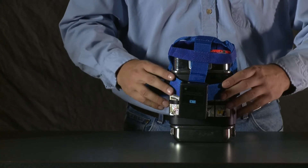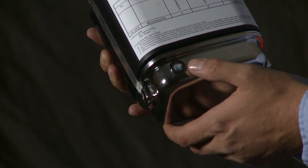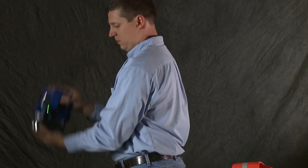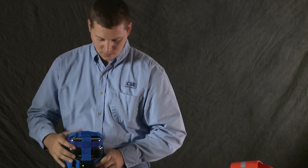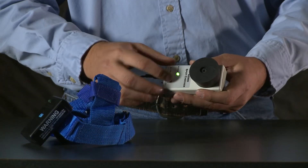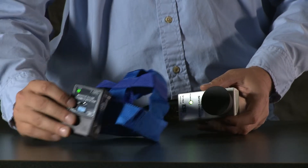The 90-day inspection is made up of two parts. One part is to first repeat the visual inspection that workers make before every shift. The second part is to check an SCSR's reliability with the CSE Acoustic Solids Movement Detector, or ASMD. You'll also have to make sure the ASMD is accurately calibrated by using the CSE Spot Checker.